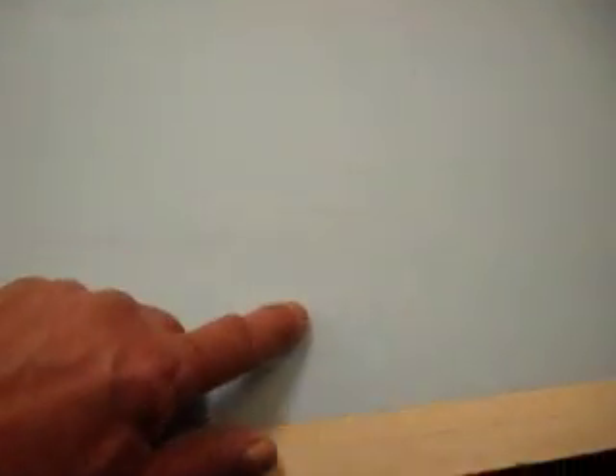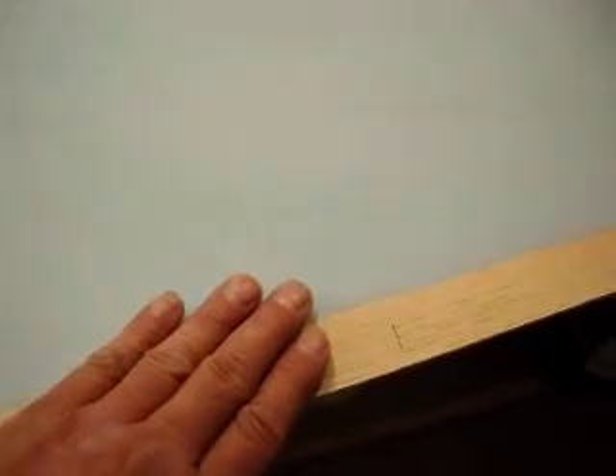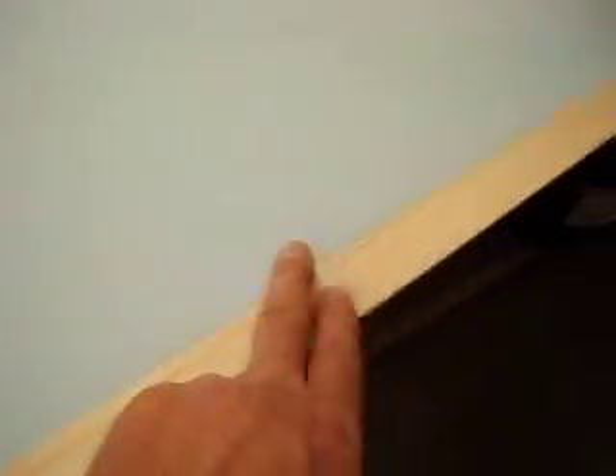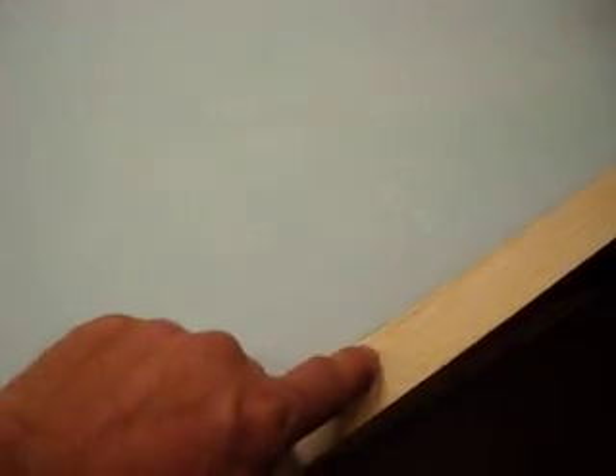We'll mold that separate and be able to glue it in afterwards. The flaps are kind of weird on these — the skin comes down here and back up, and the flap is a big piece that goes under, and then the spoilers go right next to it. So we're going to make all of them separate, just use the skins off of these. We won't be cutting any flaps out — we're just going to put the panel lines where they go and then cut it out.